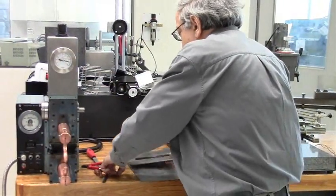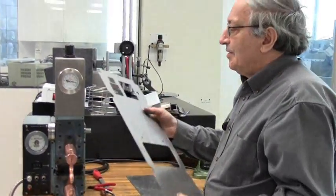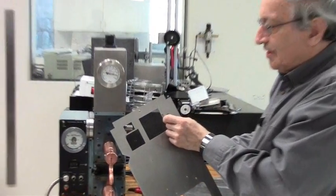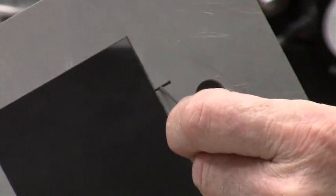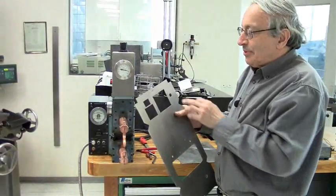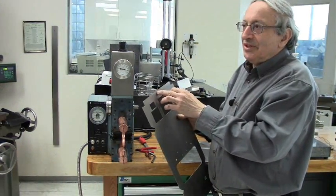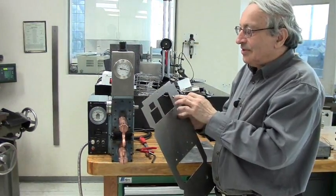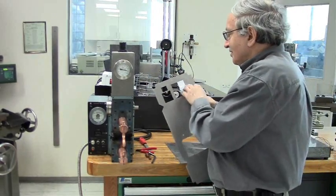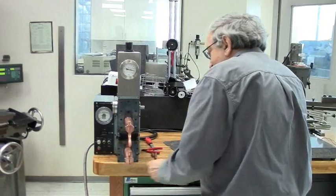We have the parts cleaned up. There was a little error in the file — you can see there's an extra cut here which isn't needed. That's a good opportunity to show how to repair mistakes with the spot welder, because sometimes you put in an extra hole you didn't need, or a misplaced hole or cut. No need to scrap the part and wait another seven minutes — you can fix it.